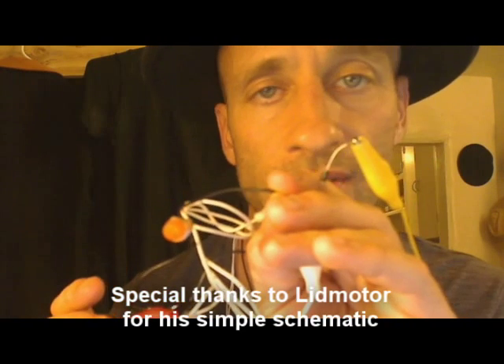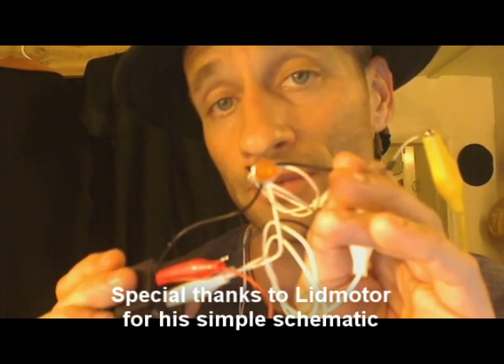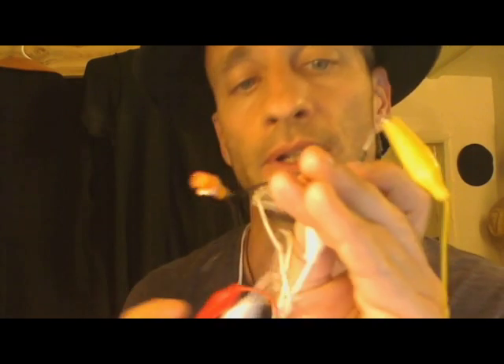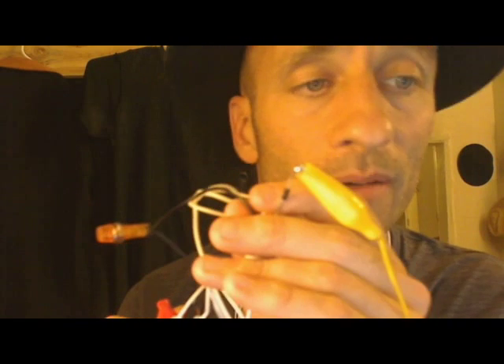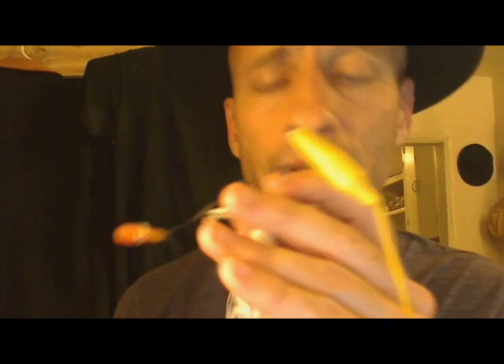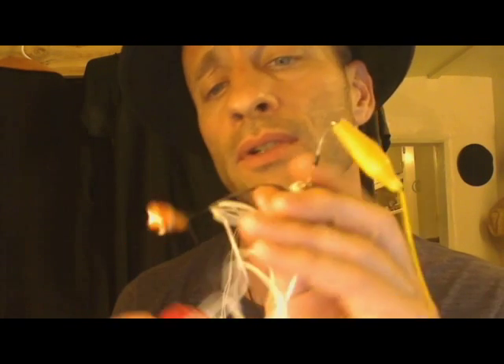The other end of the neon also goes to the diode. The neon is there just to condition the line — to keep from frying the circuit if you're not actually charging something, because it will fry the circuit. These things are cheap but not free, so you definitely want the neon. It's a 110V neon you can buy at Radio Shack for about two or three bucks.